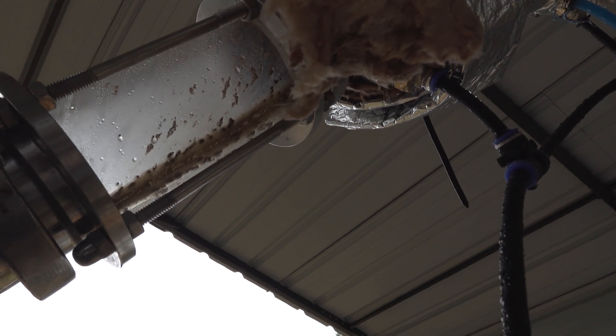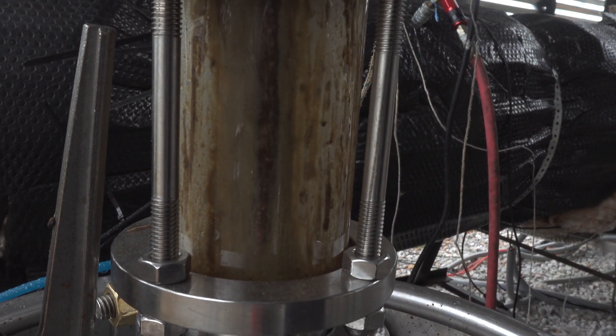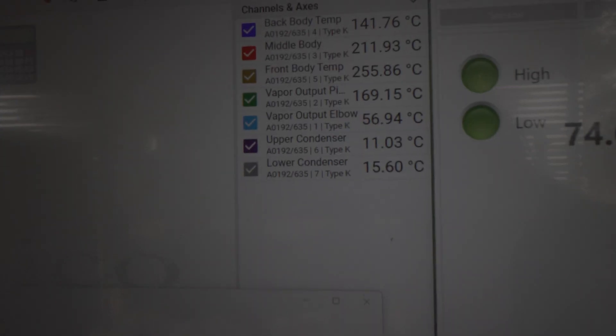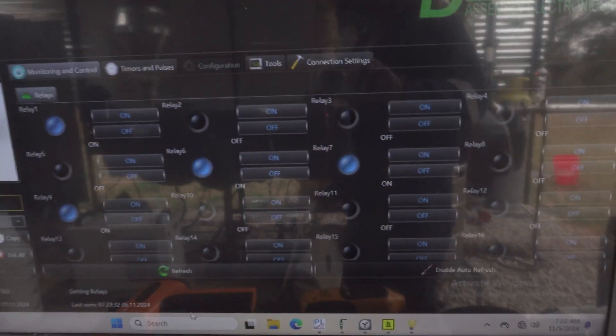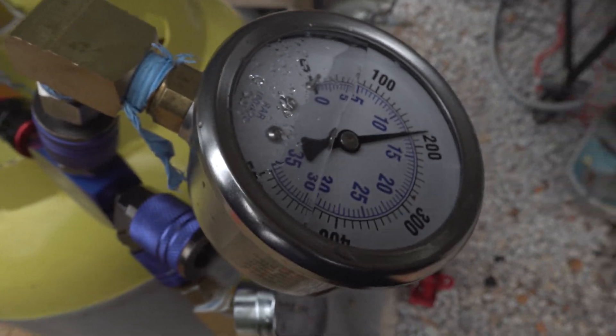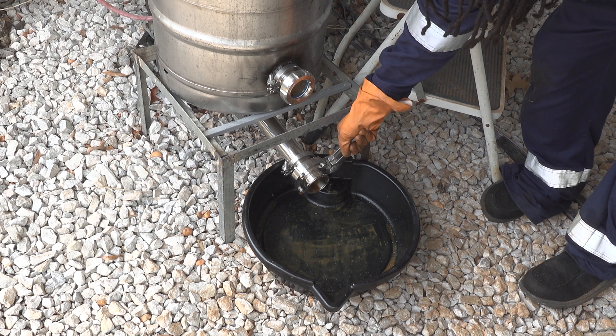Now we only have three magnetrons on. Oil is still coming out at a consistent but low flow. I was like, at this point I'm going to stop the machine pretty soon because I'm not really impressed with this oil flow and I don't like how it looks either — it's ugly. Two hours and thirty minutes in: temperatures starting to get hot, 250°C. The machine probably could have run for another hour, truth be told. But I started to stop it there.